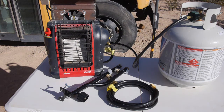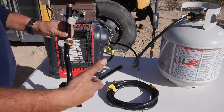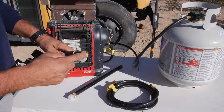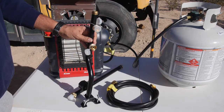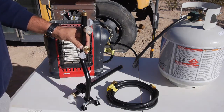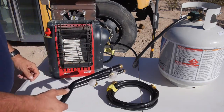No, that's okay. That's the heater setup, and the last thing I'm going to say on these are sealed quick disconnects. I mean, you screw them. It's not just a quarter turn, or not like an air compressor where you just pull the thing and snap it on there. But these are made to seal when something is not connected to it. That means I can have one appliance hooked up, leave the other 2 ends disconnected, and the propane won't leak out of that. So not a big deal if you only have one appliance and you want to hook it up. You don't have to have something connected to every fitting, and then you'll be okay. So for instance, if I don't need this right away, put that back in the bag, just use that.